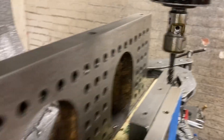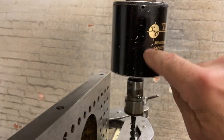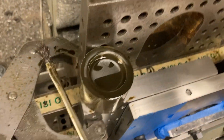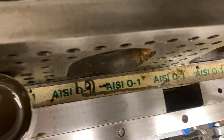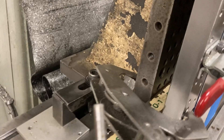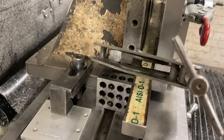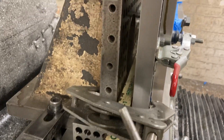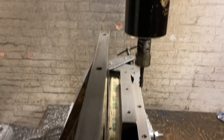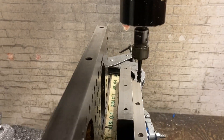This guy right here — got to clear that. But when I put it on there I found the height didn't jive properly to make everything work and clear the tapping head. So I had to take the whole setup apart, take it all down, and put some parallels — actually O1 tool steel bar stock. I stuck that bar stock behind those plates and reset it up another inch and a half off of the back wall of that big angle plate. And voila! I now have enough clearance for the tapping head to come down, clear the back of this thing, and be able to tap my holes to the proper depth.